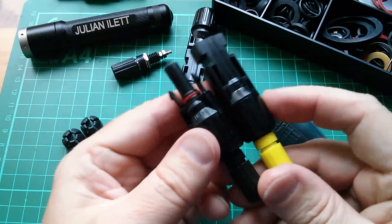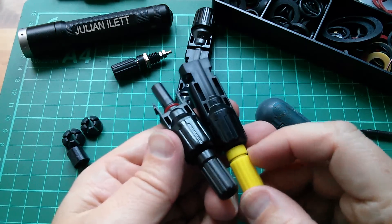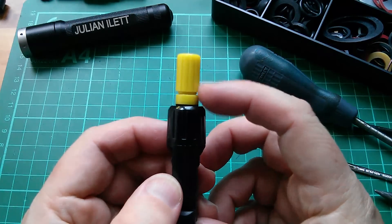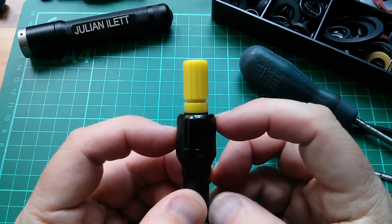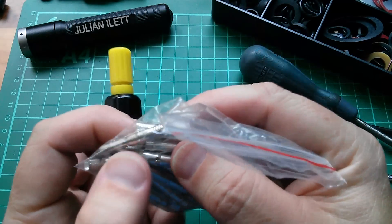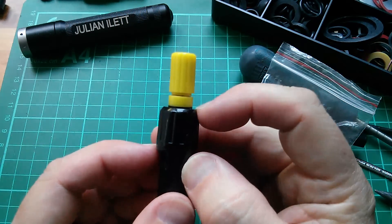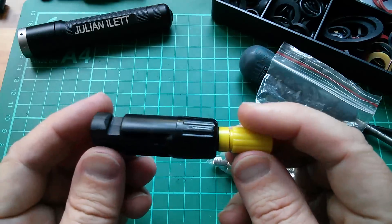So that's the black and yellow, all freshly made for this year. Let's take them outside and connect them to the solar panel. I think one of the reasons the water got in was that this terminal doesn't sit quite square — it's leaning over slightly to the right, or to the left if I turn it around. That's because the metal wings of the connector only sit on one half side of the housing, so the terminal gets pushed over slightly and left a little gap. With the new o-ring in there, that should hopefully seal up that gap and stop the water getting in.